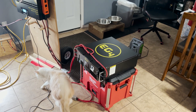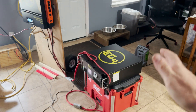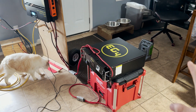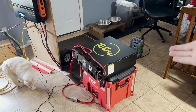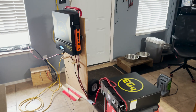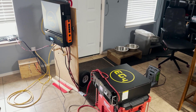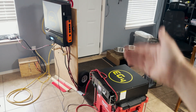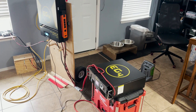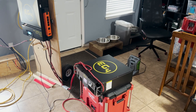Something to note: this battery is UL listed and UL certified, and the reason that's so important is because on certain installations you need that for the code of whatever area you're using this in. But just to be on that list and become certified tells you how good this battery is, how much redundant safety is built in, and how reliable it's going to be. The next video we're going to build our 48-volt system, assemble a raw cell 48-volt battery, put it in parallel with this battery, and connect everything to the inverter. I appreciate you guys watching — put questions or comments down below and I'll see you in the next one.